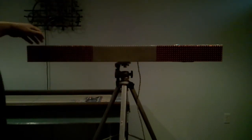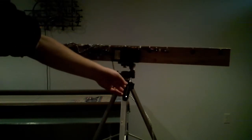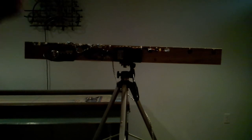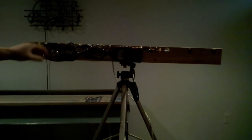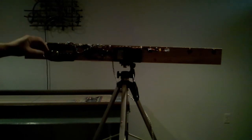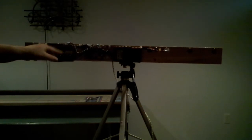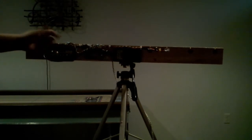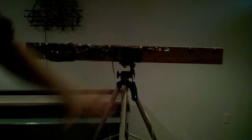Now it's based on the Arduino Uno. I'm going to switch this around. On the back is the Arduino Uno that I put in here, and I've got a little cable that I can use to program it. You can see it says lights, reverse, left, right, hazard, braking, throttle. That was all left over from when I used this as a demonstrator. But I've made this one the red switch, the green switch, the blue switch, and an indicator. So I'm going to shut all those off, and then I can set the values to anything. So I can make this display any color, any brightness, but I'm just making it all one color.